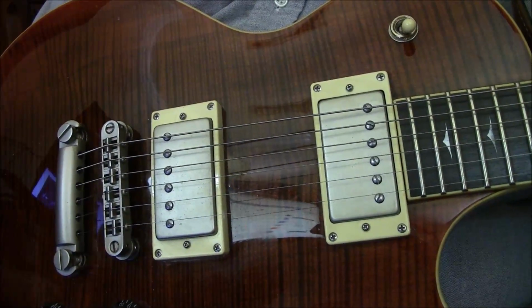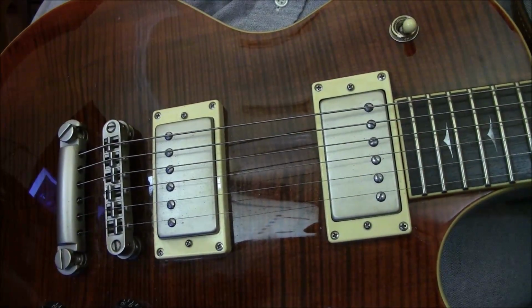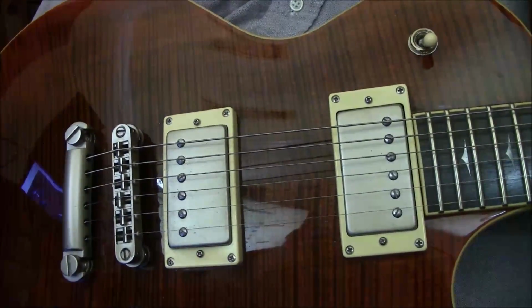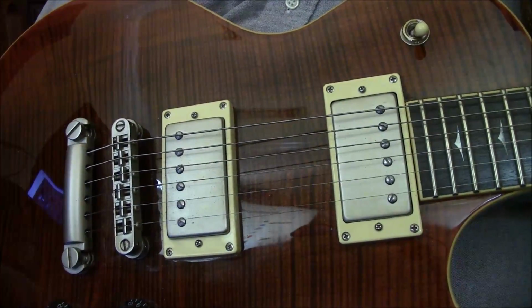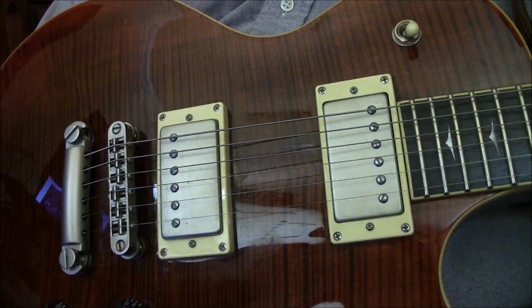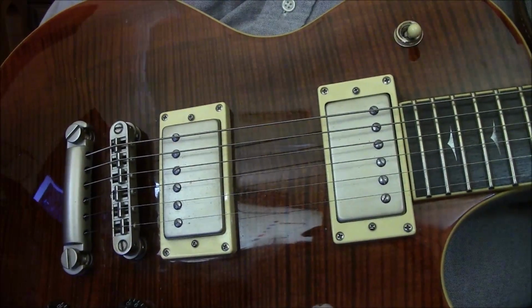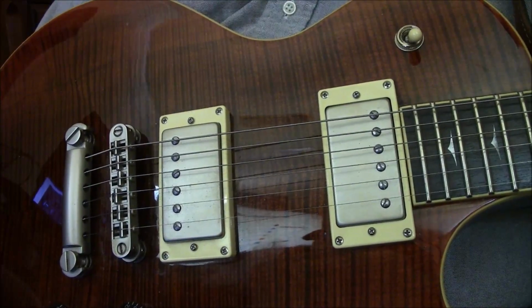The second thing to do is ask the owner when it was retubed. When's the last time new tubes were put into it? Does he have receipts for those too? A good owner will have those. They'll have those receipts showing when the new tubes were put in. If they have none of the above, start being kind of leery about that amp.